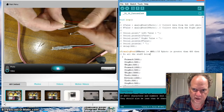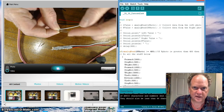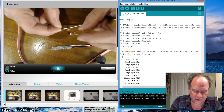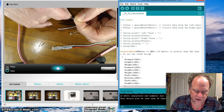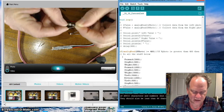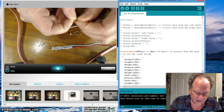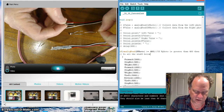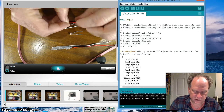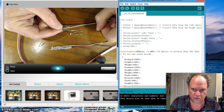I've talked about these before. The longer wire is the anode, or positive side. It's the side that's ultimately going to hook up to your battery or whatever it is, and it's going to supply the current. The shorter side, which by the way has a really small flat on this piece of plastic that you probably can't see, is going to be the negative. I want to restrict the flow of electrons going into the LED, so I'm going to twist these wires together like that, and we're going to hold this all together.